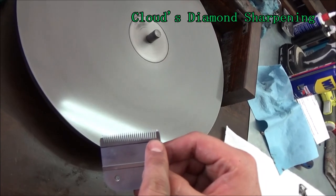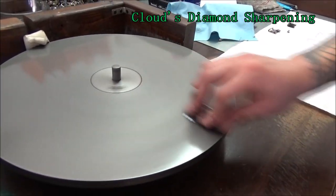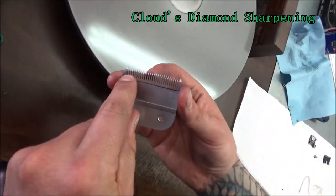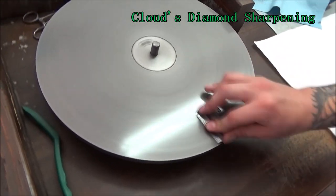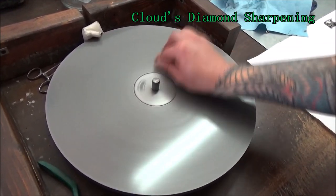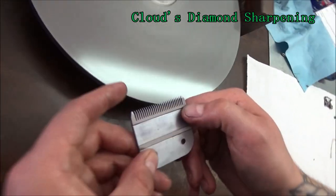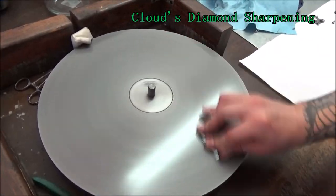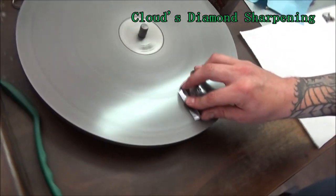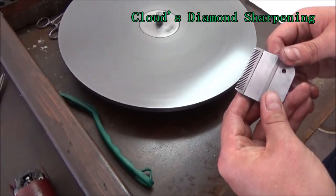You can still see the sides are a little flat over here. So now I'm going to do a second round — I go about 20 passes each time I sharpen. This will be my third time sharpening because it's still a little dull on the sides, trying to put that shape back in there. Don't run it backwards to get that shape back in there. But I'm just removing life because I used that block — just wasting blade life. Still a little dull on the sides. That's pretty good but there's still a little more. Okay, so that's perfect. It looks flat but it's not.